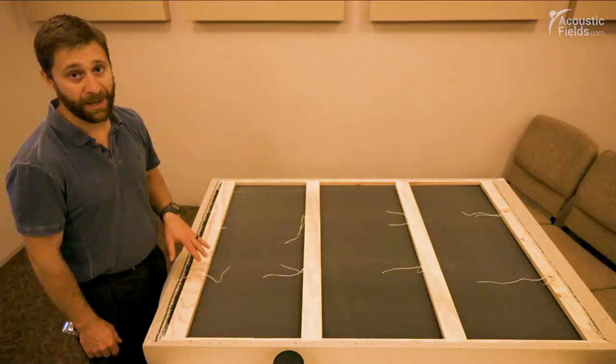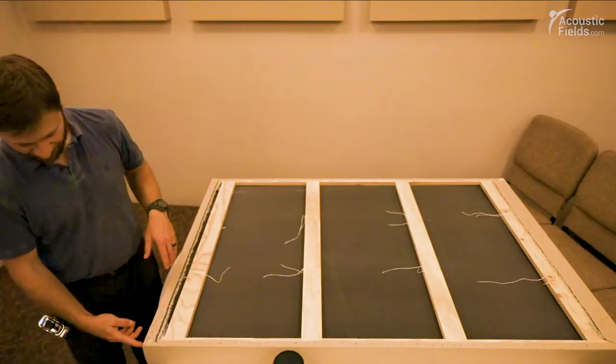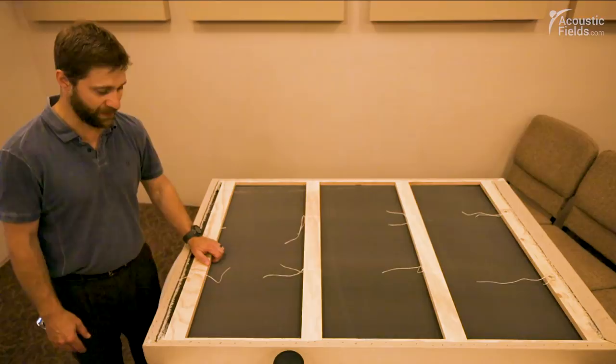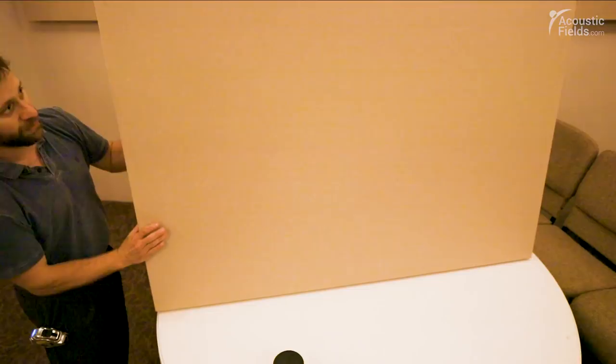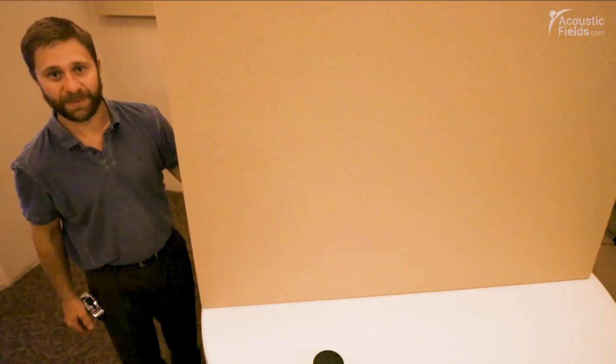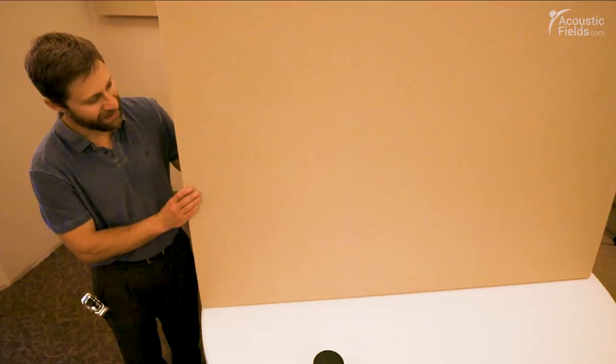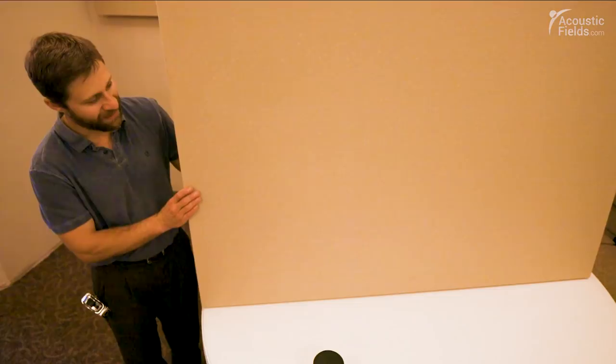It's a pretty simple process — you just set your saw up to two-and-a-half inches, rip all your plywood, and once you have a system it comes together real good. You just glue and screw — pretty straightforward, pretty simple. It gives us a really nice, clean, sharp look on our panels, and they're pretty light. Not a lot of wood, so it keeps them light. You're not struggling or wrestling with them, but you can see how it's nice and tight and that dresses up pretty good. That's a quick rundown of the construction on these frames, and we've really been impressed with this product — it's done us real good.